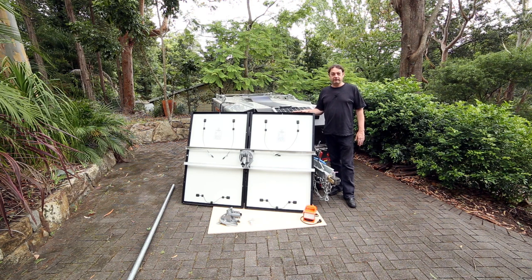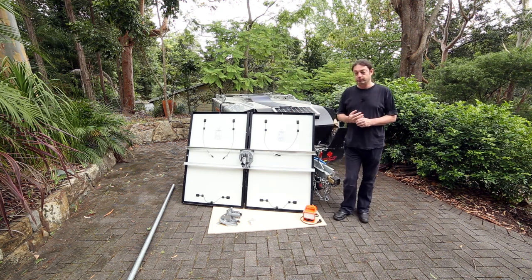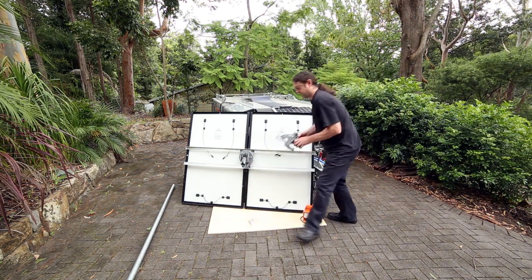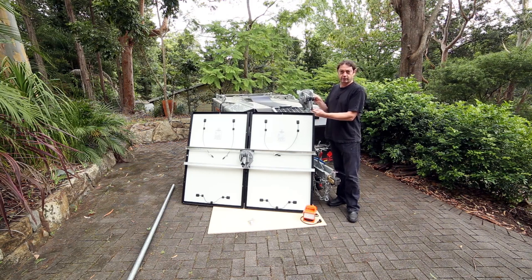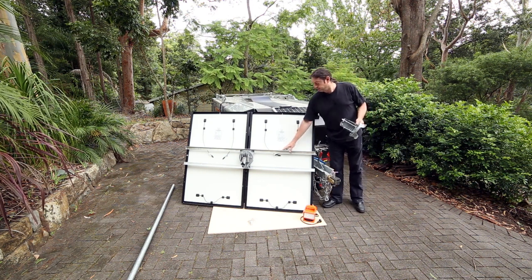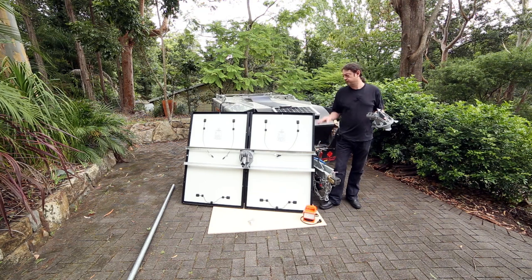What I've had a hankering to do for a while is actually build a solar array mounted on a pole. I sourced this fantastic kit from Affordable Solar Mounts in America. Mark sells these kits at a really great price and they come with this little mounting bracket which sits on a pole — I've got a pole over there, it's about 42mm or so. He also sells the rails with the kit; they come standard 2.1m, however he will cut them to the length to suit your panels. I told him the size of these panels and he pre-cut them and sent them to me.